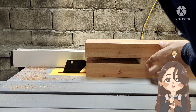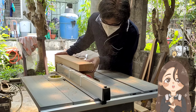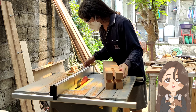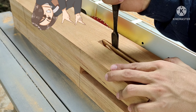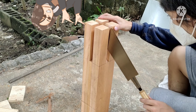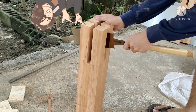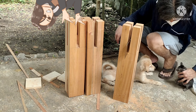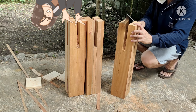I'm not cutting through and through — I marked my fence with masking tape so I know where to stop. I go to the table saw first to establish a straight cut, then I hand saw after, because my table saw cannot finish the cuts. If you use a hand saw all throughout there is a risk of not having straight cuts. A little more elbow grease, but this is the most efficient way with the tools available to me — do with what you have and be creative.